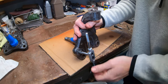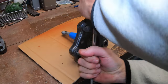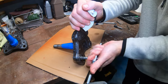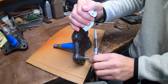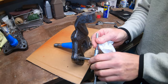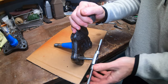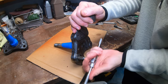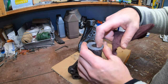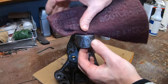Again, these are half-inch 20 fine thread bolts. I brought these inside since it's a little cold in the workshop and I want to get these painted — I also want them to warm up a bit. Once I run a tap through all the holes, I'll go over them again with wax and grease remover, let them dry, then hit them with primer. I'll run outside with them, hang them on a hook, spray them while holding them, bring them back inside to hang and dry. The ambient temperature is high 30s right now — no good for painting.